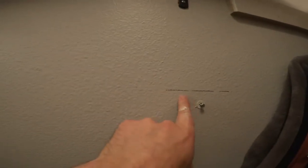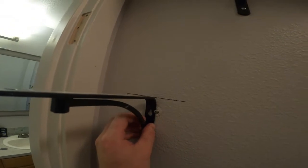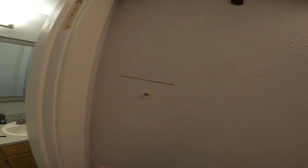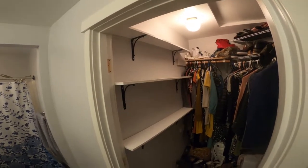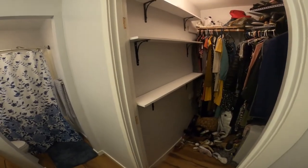I was a big dummy on the top shelf — drew my line out, punched the holes for brackets, and didn't realize it was actually higher because of the curve in the bracket. Learned from my mistakes: mark where the shelf is going to go on both ends, then put the bracket up to line the holes flush with the line. Since the bracket is slotted, I can set it down, mark and drill out the bottom hole on both sides. Got all three shelves up.